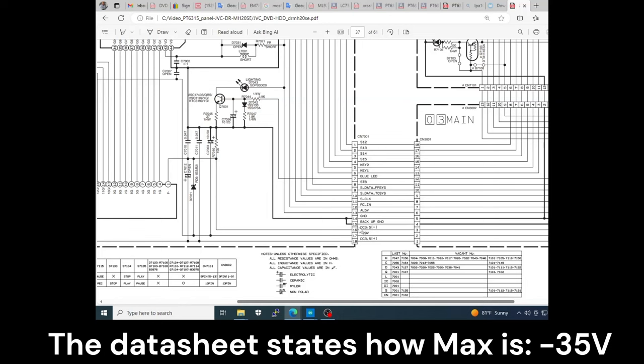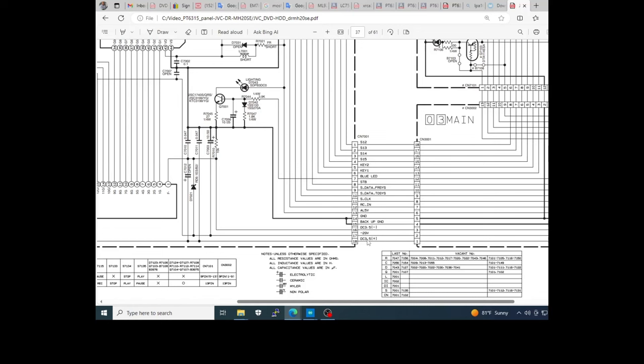The filament voltage in these two points is 3.5 volts. They use DC, it is a funny thing, they suggest using DC, okay, fine. You have an external LED present on pin 7, controlled by the transistor present on the PCB.